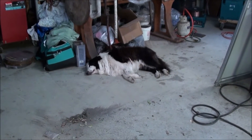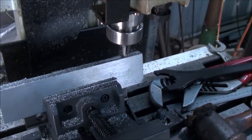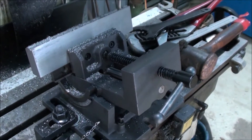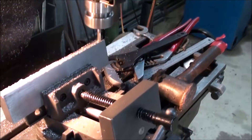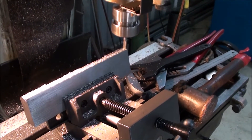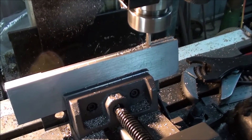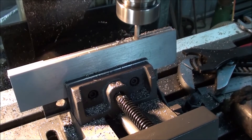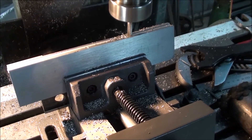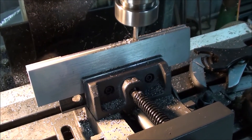Supervisor's hard at work, keeping an eye on what I'm doing. So what we're doing now is we're cutting the groove for the slot. These are 1mm deep cuts at 1600 RPM. It's a 6mm cutter, which is getting up into the quarter range.